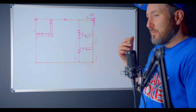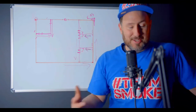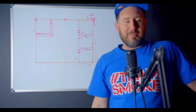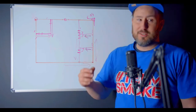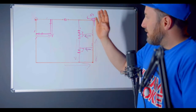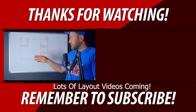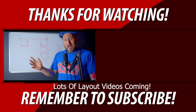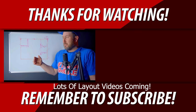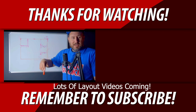You just got to continuously think about where the drywall is going to go — it's really that easy. The more you practice drywall, the more you're going to understand layout. I didn't fully understand layout until I went drywalling full time. If you don't do a lot of drywall, you can ask the drywallers how they like drywalling so you know where to put your studs. Just keep the flow of it in mind.